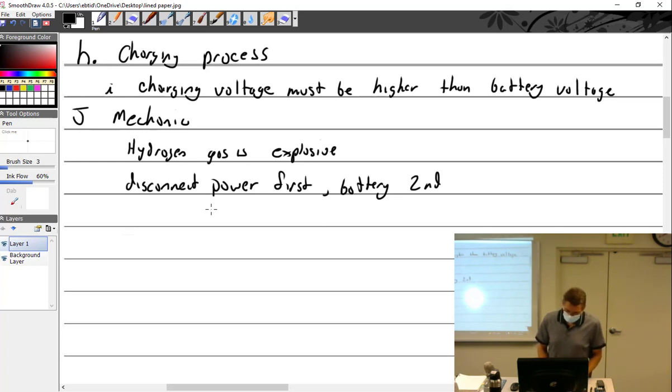A boiling battery will vent acid as well. When it gets into the aircraft, it will cause corrosion. Well, that's something to think about. I don't want to write all that, but it's important not to have battery corrosion. It'll corrode pretty bad. And so, lead sulfate is bad, so never leave a battery in a discharged state.